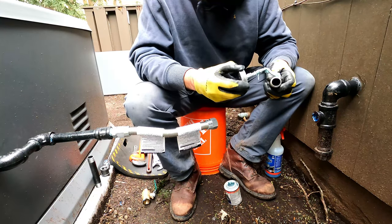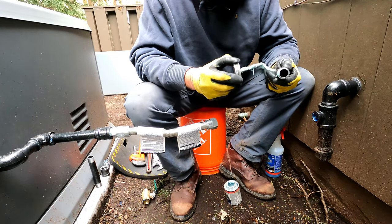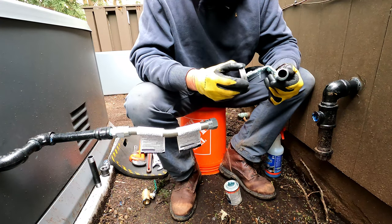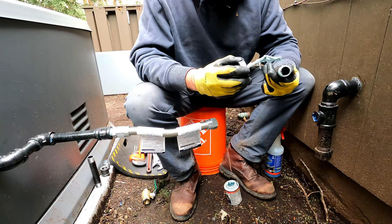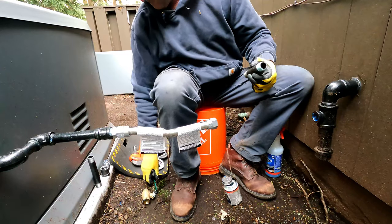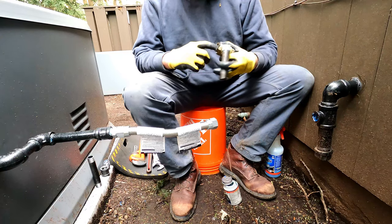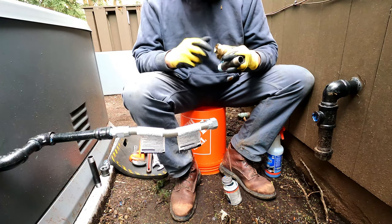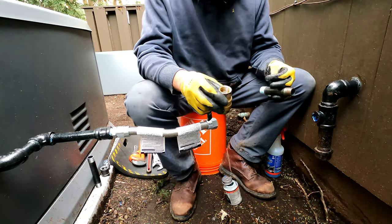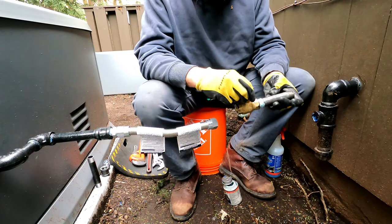You really don't need the first thread to have dope on it, but I like to use dope. I have no problem if I waste a little bit by putting a little too much on. Some people say you use way too much — maybe. But I don't have leaks. Isn't that the most important part? Always make sure your threads and everything on the inside are clean.